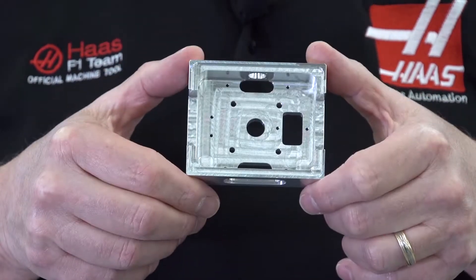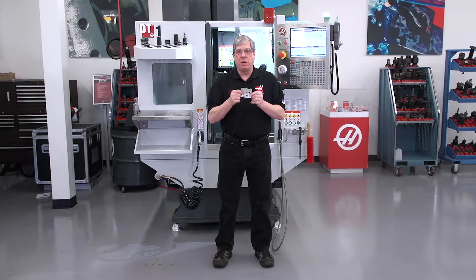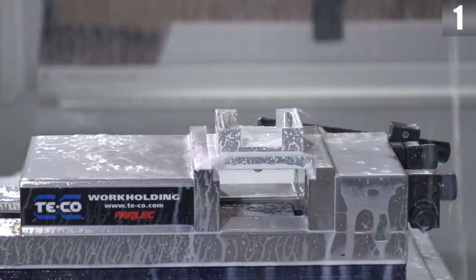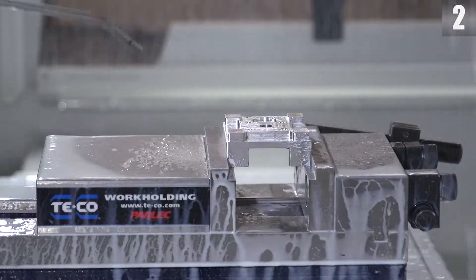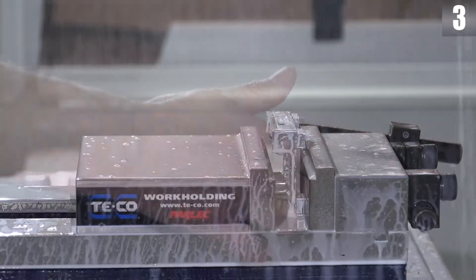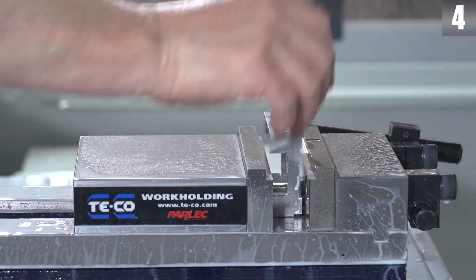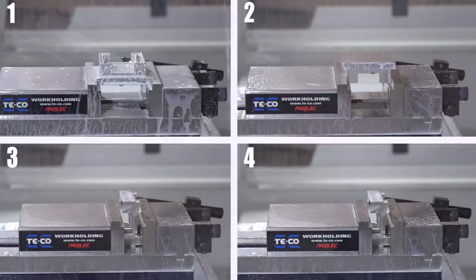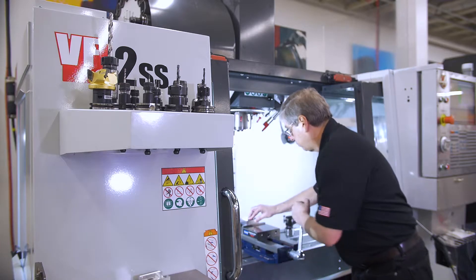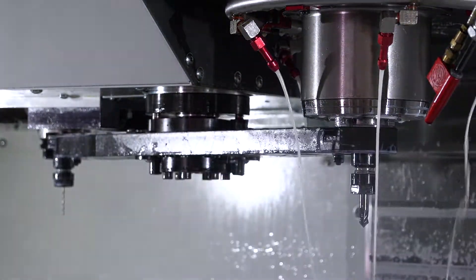Take a look at this part. It's a classic example of what I'm talking about. Think about how you would make this part. How many setups does it require? If you only have a 3-axis mill, you've got to relocate this part 4 times to complete it. Each orientation of this part has features with critical tolerances that relate to features on other sides of the part. Each time I relocate it, I have another chance of making a mistake. With 4 setups, I have 4 chances at scrap. I waste a lot of time running parts this way. Cycle time really adds up when I have to recall cutting tools used in a previous operation.